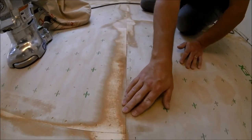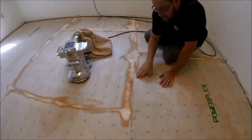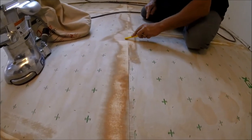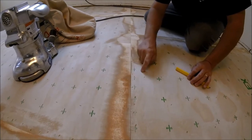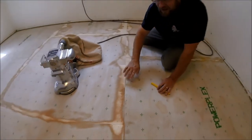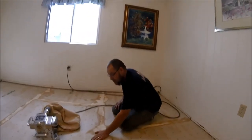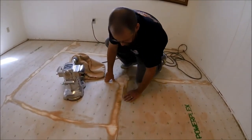See how this side is sanded and this side is not? It's almost a fact that the unsanded side is going to be lower, because the sander is only riding on one side. So if you see one side not touched, you can still feel that bump. Watch — back here where both sides are touched, it goes right over smooth. That lets you know if the sander is not touching both sides, whichever side it's not touching is going to be lower and you need to do a little more work. Even just reaching down and feeling it with your fingers to check it. Always run your sander fast — don't sit in one spot because you're going to dig a dip in the plywood and it's going to be noticeable when the light hits it. Make sure both sides get sanded.